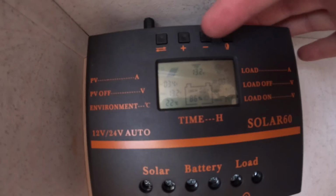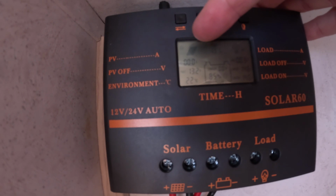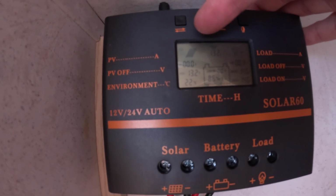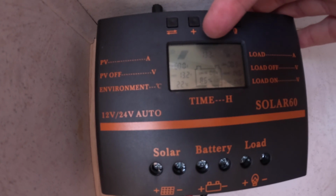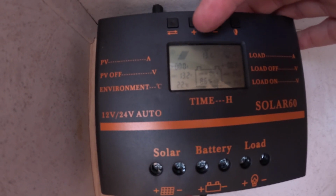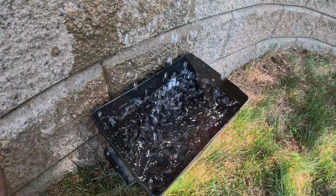So currently right now I've got my solar controller dialed down to only ask for 13.2 volts in my battery. So this is what it looks like. It's asking for 13.2 volts, and you can see here my solar panel is just kind of blinking in and out, right? So it's going from 0 to 3.1, 3.4, and this is amperage. So this is actually voltage times amperage equals watts, right? And so this is my solar right now kicking in just like the sprinkling of the water. So my charge controller is dialed almost all the way back, and it's just trickling water into the battery reservoir.